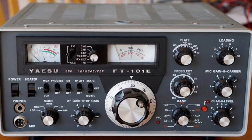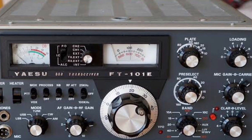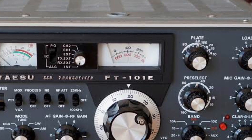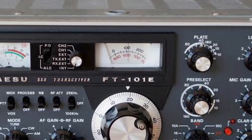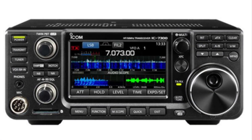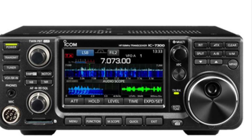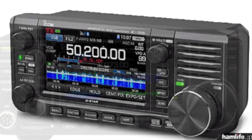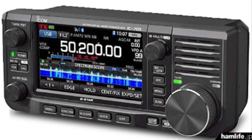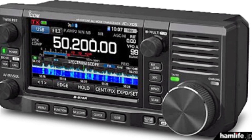This wasn't a problem with older radios like the FT 101, which were designed to work with these older amplifiers because their keying output was really nothing more than a pair of relay contacts. It didn't matter that there might have been high voltage or high current — it was just relay contacts. The situation is quite different with new radios; they almost always have transistors — quite small transistors with very limited current and voltage handling capabilities. What we need to do is provide an interface between the new radio and the old amplifier.